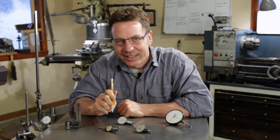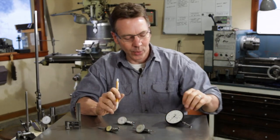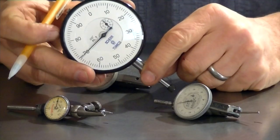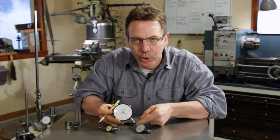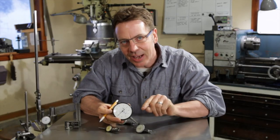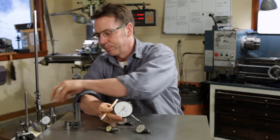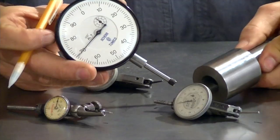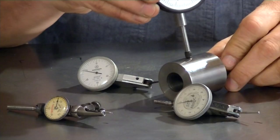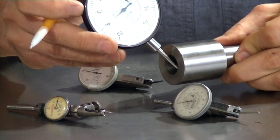What is a test indicator and why is it different than a dial indicator? Let's look at a dial indicator. The real difference is how this probe moves in and out in a linear fashion. On a test indicator, it actually pivots on a point and only moves about twenty thousandths of an inch. Also, the way they read is different — this one really can only read an outside measurement like this; it's not good for an interior reading.